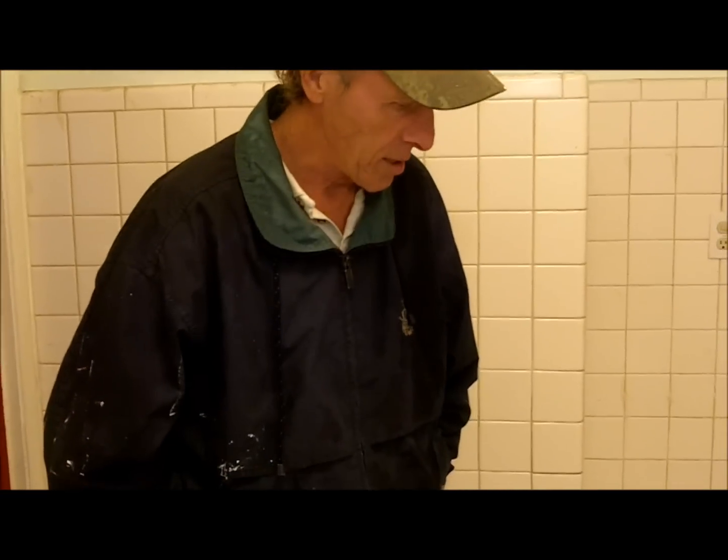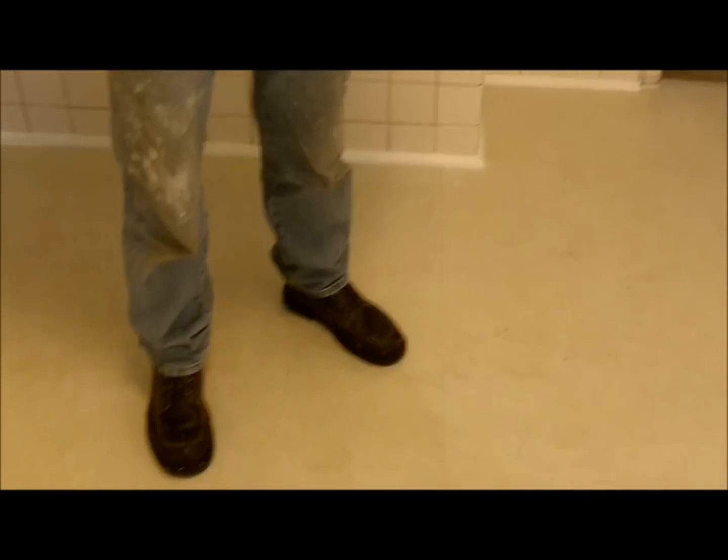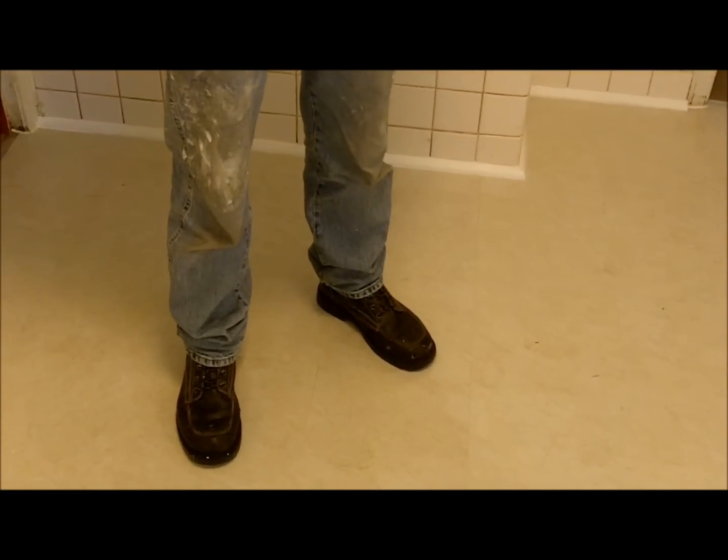And then on this we use a self-stick tile. These run about 99 cents a piece. Those aren't the cheap ones by far, and they're not the most expensive. They're middle of the line, but they're a very good, durable tile. These will last 20 years if you keep them up. I make sure I keep a little gap at the edges because you have expansion with heat and shrinkage with cold. That's why I use a shoe molding around it. That way I can leave a little gap, so it's got a little room to move. That's the shoe molding right here.